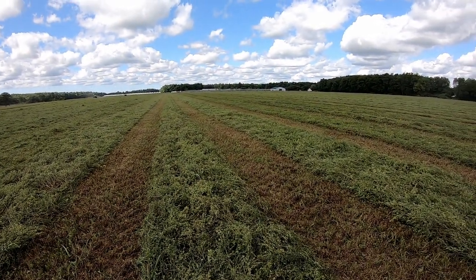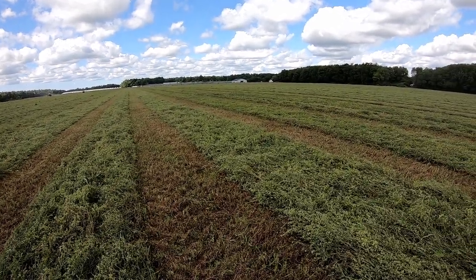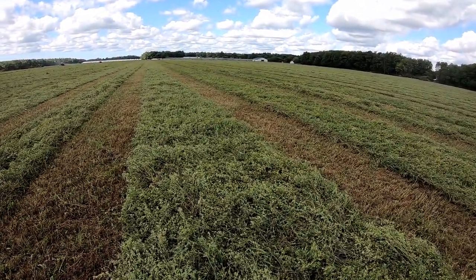It's Wednesday now and we want to be able to bale this on Saturday - if the humidity stays out, we should be able to. So what does the field look like after it's tedded? Well, it's pretty simple - it lays it out pretty flat. The Pottinger tedder that we use actually has a left and a right tine, one shorter and one longer, so when it teds it out, it actually leaves kind of like little teepees all over the field, which allows air to get underneath and dry the hay down a little bit faster. This is how the mowers lay out the hay - we call this a windrow or a cut row.